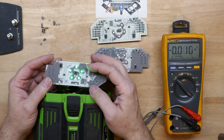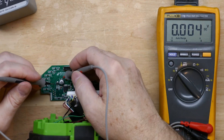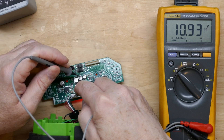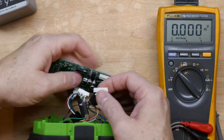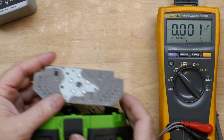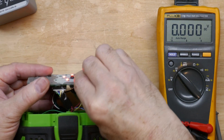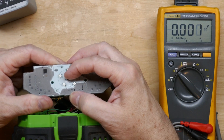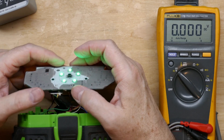In the first video we repaired three boards; the second video had some that acted a little differently but all had transformer issues. One of those boards was repaired in the last video — we got bus voltage and rail voltage up, all rails checked good. When we went to plug this board in to test with the same pack we've been using for the gen 3s, it was a no-go: blinking red. Pushing on connectors and holding the button down gave alternating red and green, definitely indicating a cell issue.